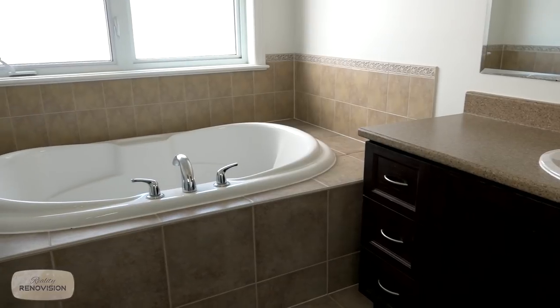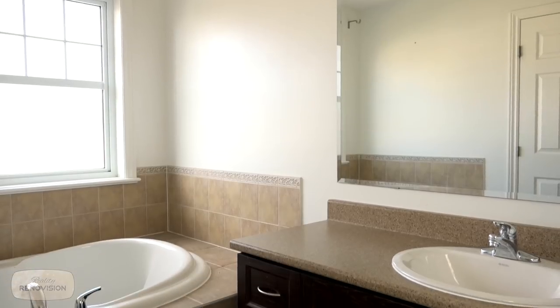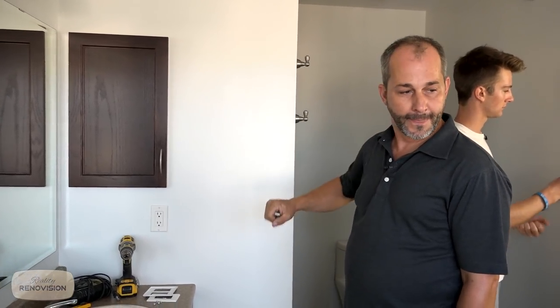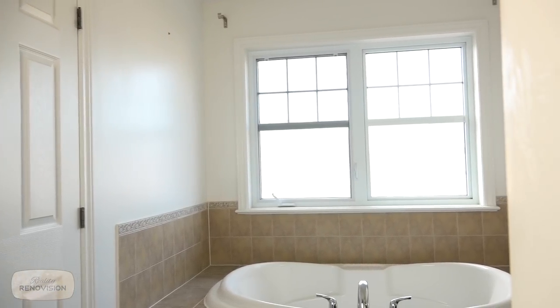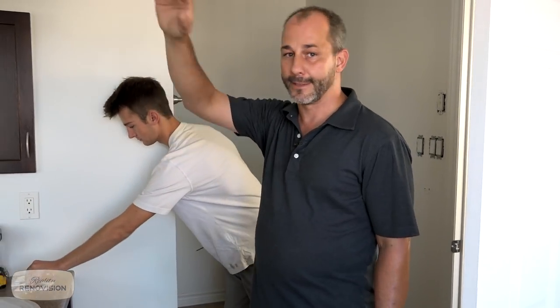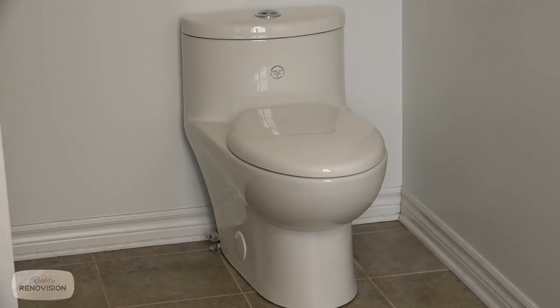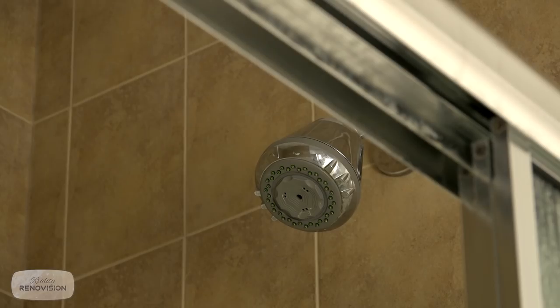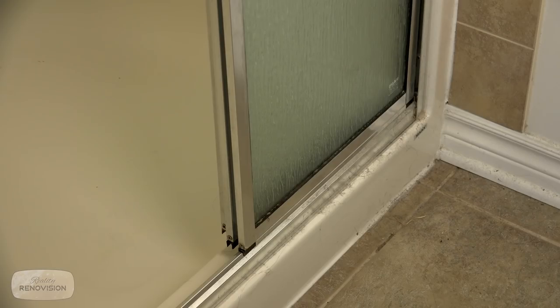So what we're gonna do is rip everything out of here, reframe the wall — this is the adjoining wall with the semi-detached neighbor — so we can run all of our plumbing and electrical exactly the way we want it. We're gonna build in a shower nook with a whole ledge, move the door over to the other end where the tub is now, and hang one of those barn doors on a nice chrome rail. That's gonna really open up the space and give us room for a his-and-hers double vanity, double mirror, double light fixture. We'll move the toilet over, this wall will be gone — just a sheet of glass — and what we'll have is a barrier-free shower with gorgeous stone, extra lights, rain shower head, shower bar, one fixture, and a heated floor. The ensuite bath sells the house, so you go that extra step with cool design features and make it a showstopper.